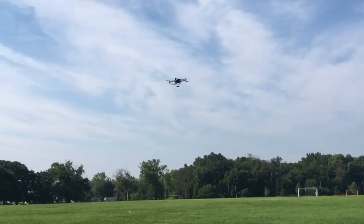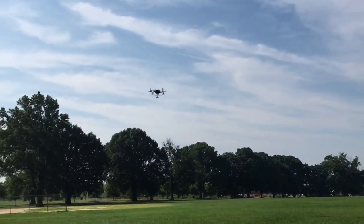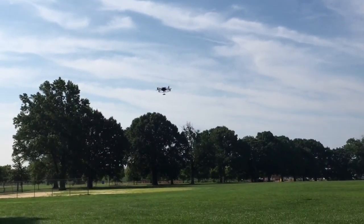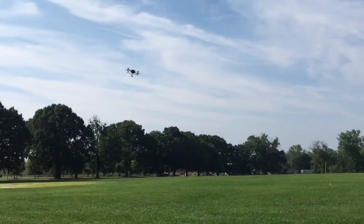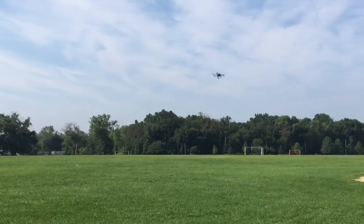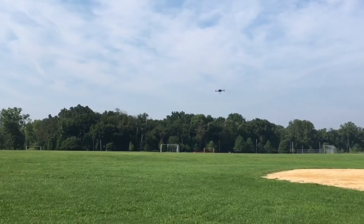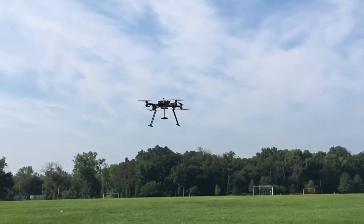We have the Pixhawk 2 in the back of the airframe, so when we're going fast in forward flight we get a little low pressure in the back of the drone just from the motion of it going forward. So it drops a little bit more when going forward because of our positioning. When you come back it doesn't do it quite as much — same with side to side. The short answer is the altitude holding is okay, it's pretty good. It's not as good as the A3, but it's on par or better than the A2.